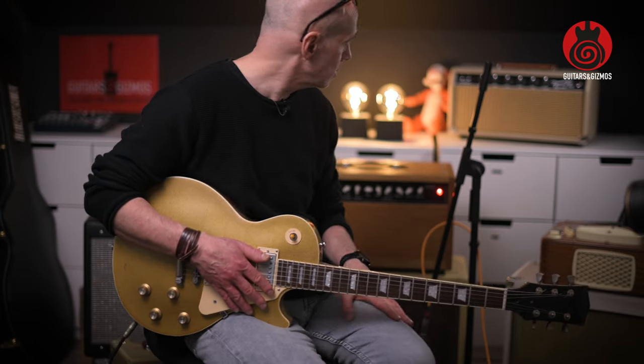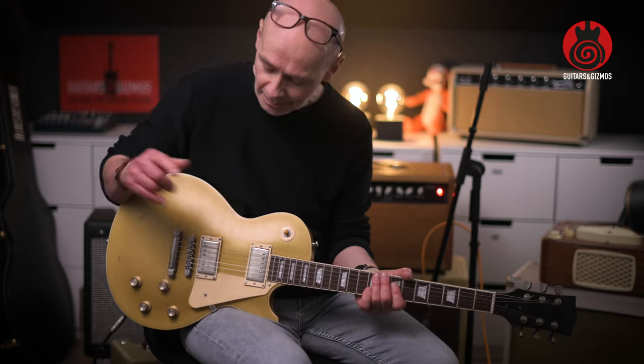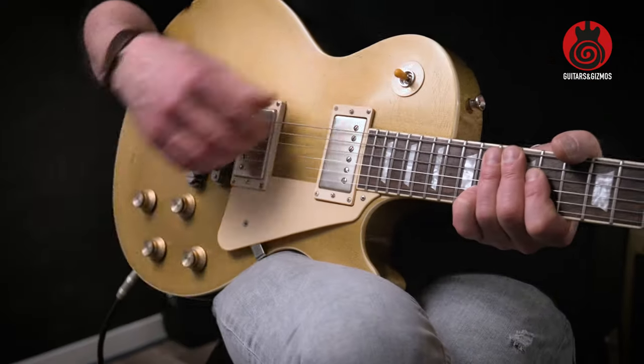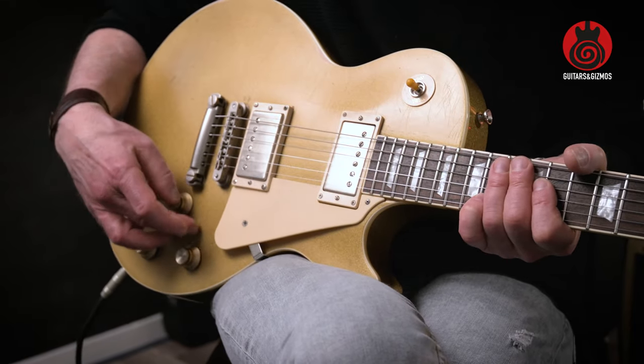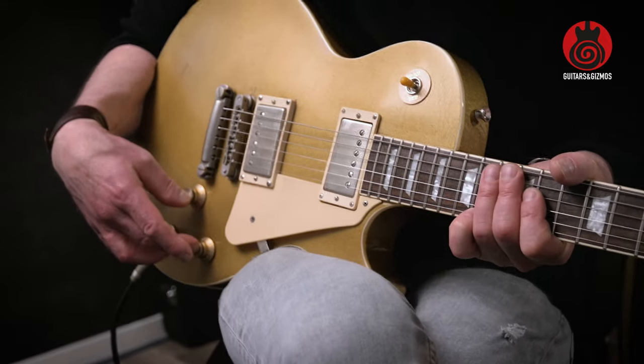On the 5-watt tweed that I have here, I'm looking at it to see if it's here, but it sounded a bit too dark, and the amp didn't have the option to go any further with the treble, so I would probably just replace these for 500K. I think the tone pots, they are probably also 300K, and I will try to go with just the volume pots first to see if that's enough.